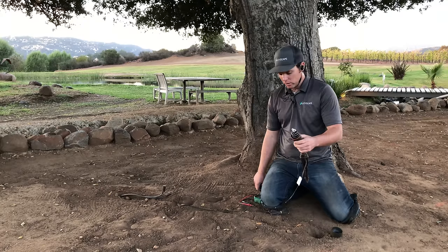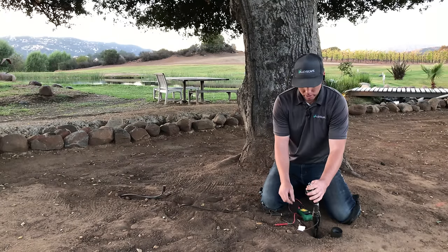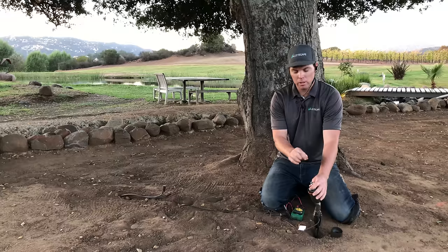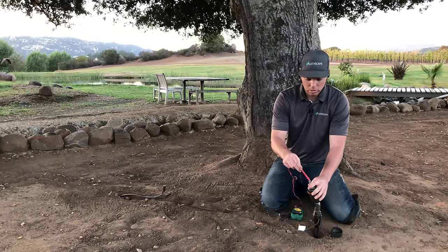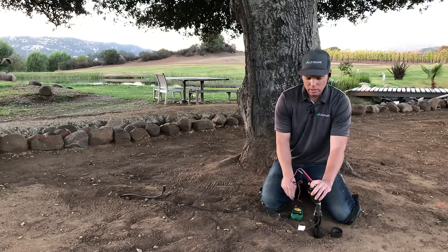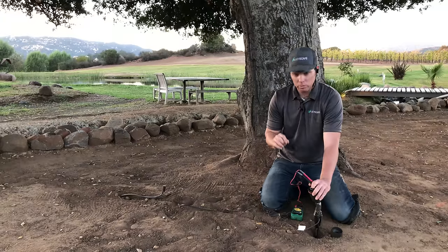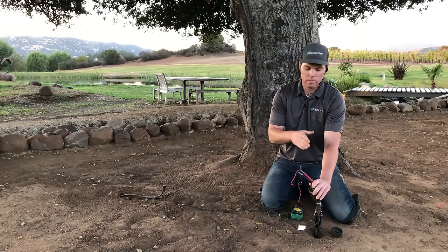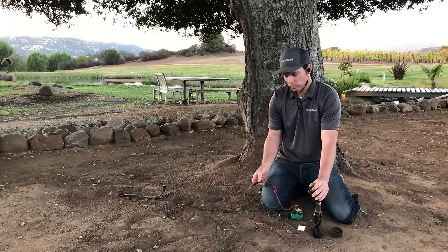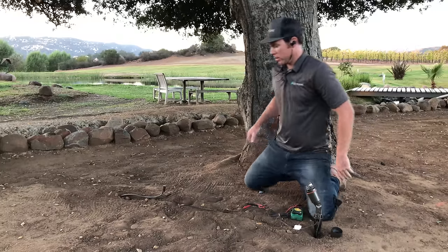The next thing I'd like you to do is go to your base here where you plug in the light. If you have a voltage tester it's going to help you a lot because it's going to tell you what's going on. Take the two prongs and put them in the little holes — with mine I have to hold it in there — then turn it to the voltage test setting. This is a low voltage system, typically 12 volts, so you need to have it on the lowest voltage setting, which on mine is 200 volts or less. If you're still not showing any power here, then the most common problem is actually with the connections.